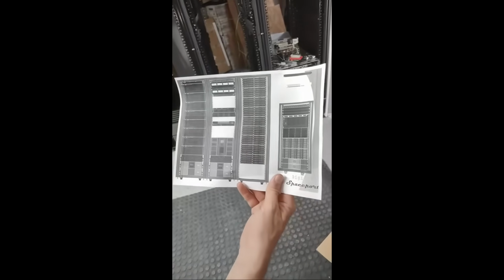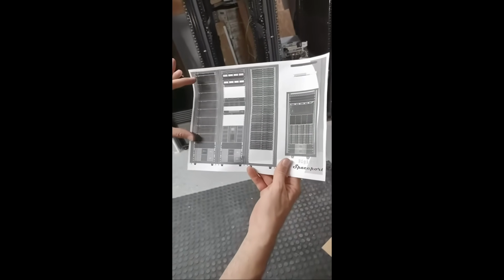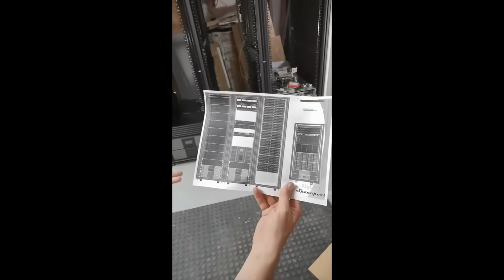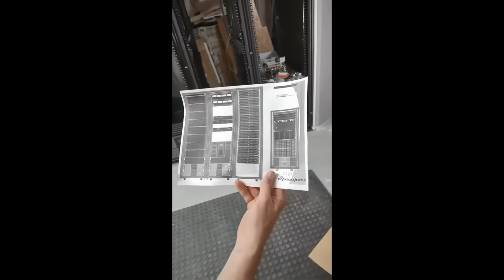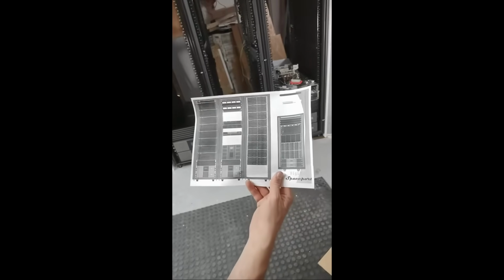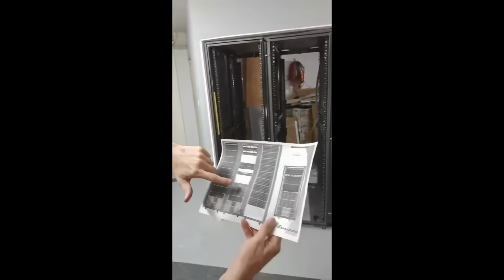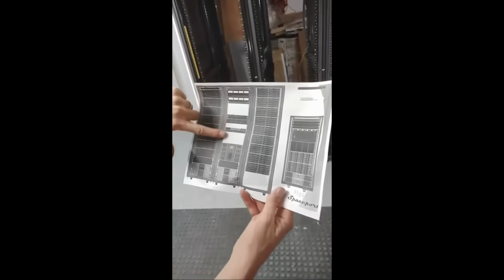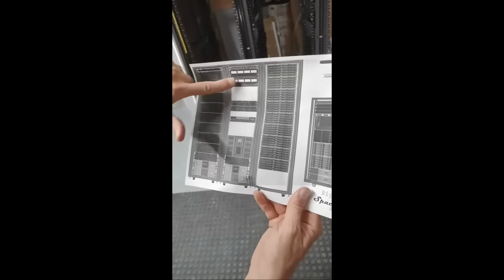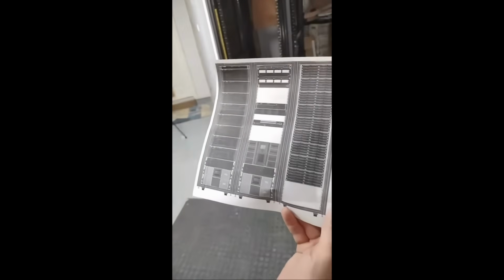So R920s, R930s do not run all the time. They do eat up pretty much one whole PDU, which is about 8 to 10 kilowatts. So that is probably why I had them all here, since I have a single PDU whip up there at the time. I've got a bunch of space here in the middle, and the networking gear is also wrong. The networking gear does not need to be in the middle. The networking gear needs to be over here on this side. I'm definitely not going to go above my head here.